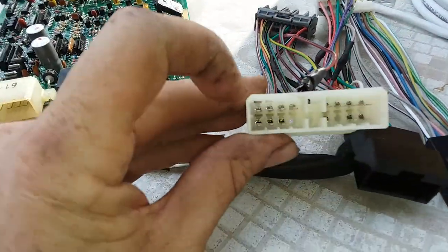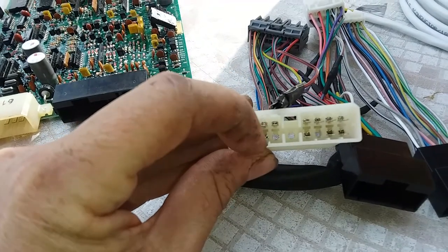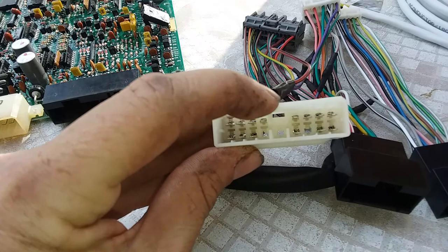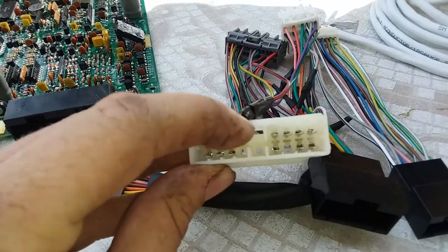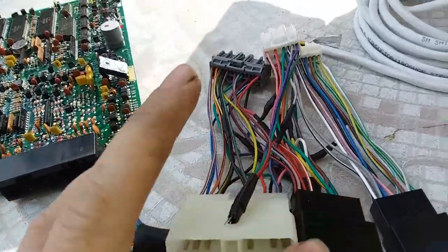Here's how you count the pins: A1, 2, 3, 4, 5, 6, 7, 8, 9, and 10. Pin 10 does not get used. Even though there's no physical notch there, you still count that position as 9 and 10, and so on.